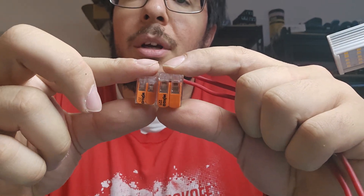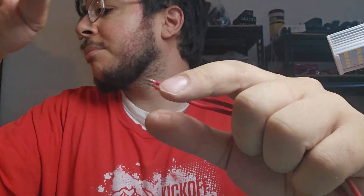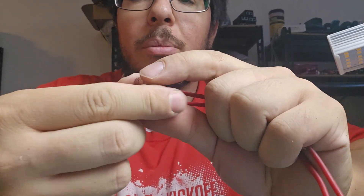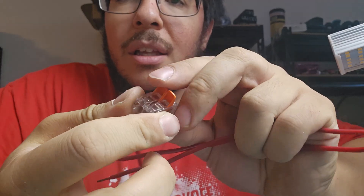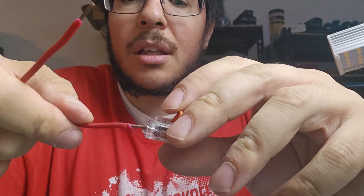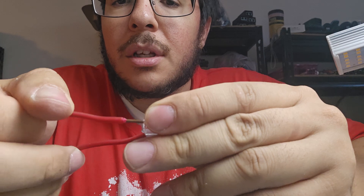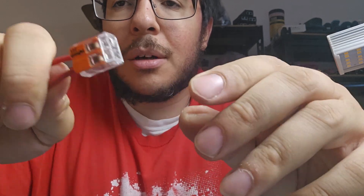My ground wire can go in there — this one's even good for a number 10. All I've got to do is open up my lever like that, just like that, open up the lever and put this in all the way, put the other one in, then click — and bam, we're done.